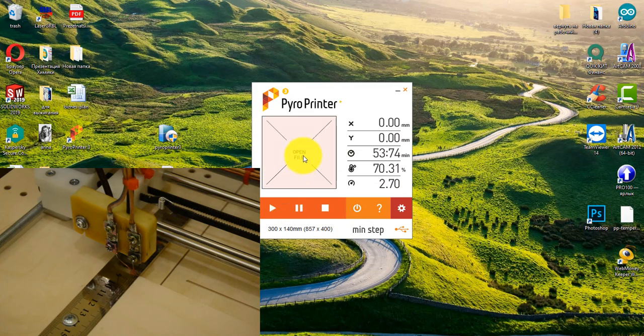Control buttons. If you click the Start button, the image will first be loaded into the memory card in the controller, and immediately after that, the image will start to burn. If this image is already in the controller, the burning will start immediately. The Pause button stops the burning process. The tip returns to the ruler. The tip remains hot. The machine will wait for the following instructions.